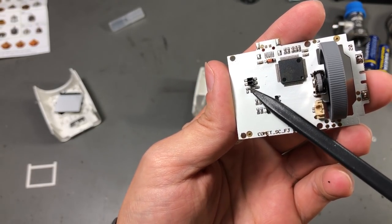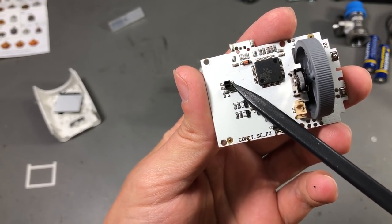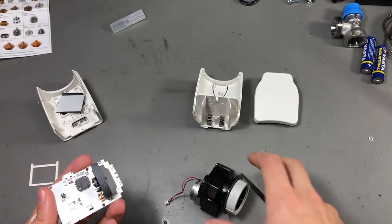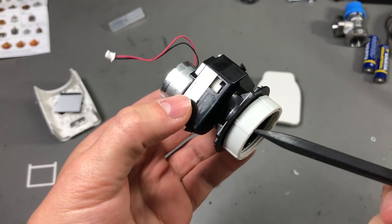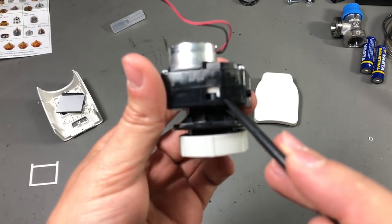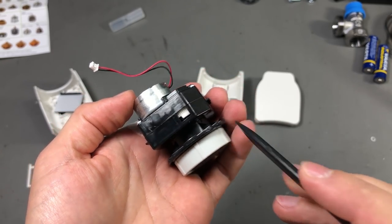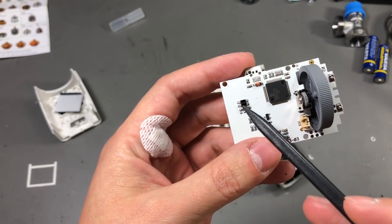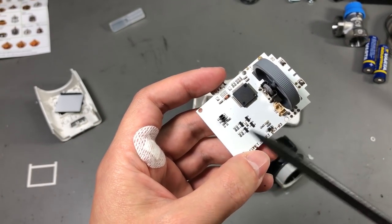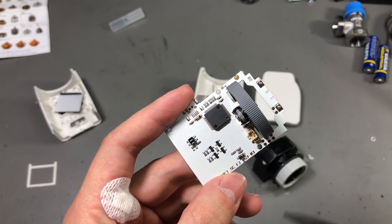Right here it seems like we have some kind of optoelectronic device, which I think is used to detect the movement of the motor. We probably have an IR LED and an IR detector that shines light through a small opening in the motor reduction box. This wheel moves as the motor turns and has a small white plastic part that turns in front of the sensor — that's used to detect how far the motor has moved and if it's stalled. There's no current detection on the board, so this is what they use to detect the end of travel for the motor.